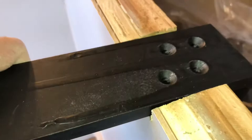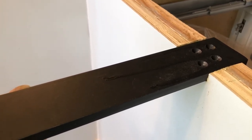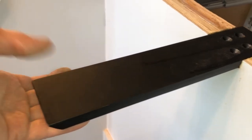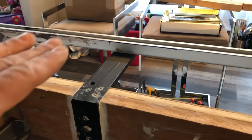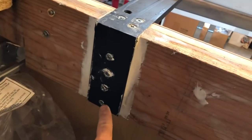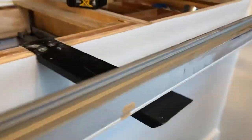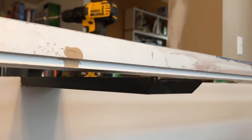That's how you do it. Make sure it's level — if this end is aiming downwards, use some shims or a lot of liquid nails to get it where it needs to be before it's solid. You need to put a level from here to there or this bracket won't serve its purpose. I put a lot of liquid nails back there, in here, and over here, then put in one screw. It's easier with two people. You need a straight edge all the way across, acting as your countertop. You can see it's flush — when they add the countertop they'll put some liquid nails or silicone and set it on.